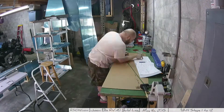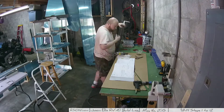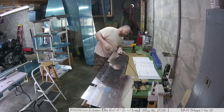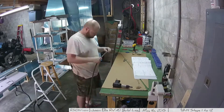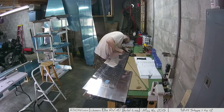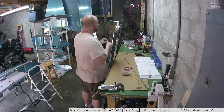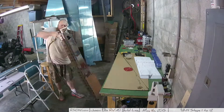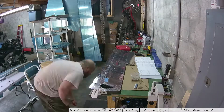You saw me checking hours and going over the instructions before I move on to the next step. Right here I noticed I had missed one rivet and that's what I'm doing there. Now we're working on 9-14, getting closer to the end of this section. This is where I was talking about the area where you needed to be able to lift the skin, and I couldn't because I'd riveted it down. I just went in through the flap door - that little panel left open - and it was trivial. That little two or three pound tungsten bucking bar is really handy; it's pretty much the only one I use.